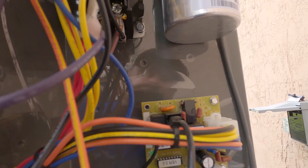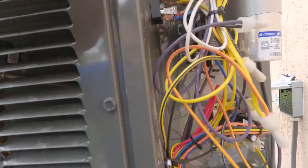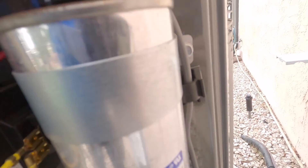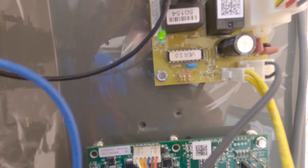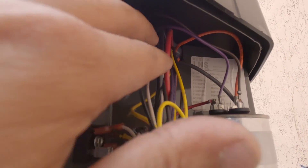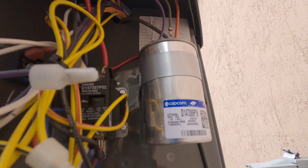Get a good look at your contactor contact points — they look okay, don't see any nicking. Capacitor terminals look good. High voltage going into the fan wires look okay. The wires going through the cabinet look good — nothing's chafed.